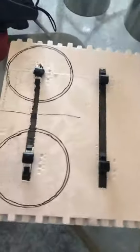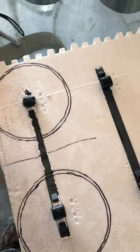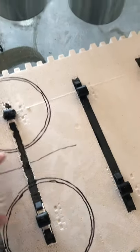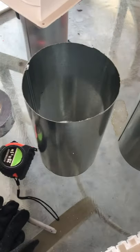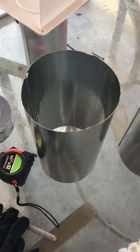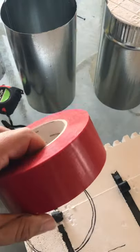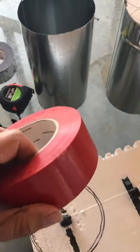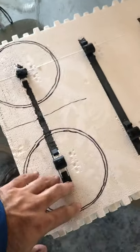I have another video on the knockdown system. Almost all the panels were good, but this one and another one had this area either too high or too low, so it wasn't quite right. You probably don't want to put all the concrete pressure on just a flimsy metal pipe. Most of the pass-throughs are usually PVC and are self-rigid — you just tape them up on both ends. I recommend the red tape for doing your plastic under your slab; it works really good, lasts a long time, holds up in the sun. Making these little circles here so I can put them in there — it'll hold the shape and take the pressure.